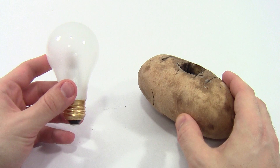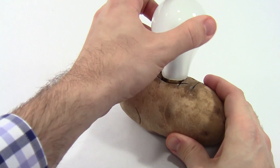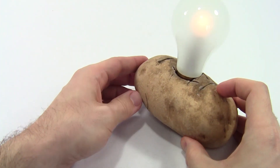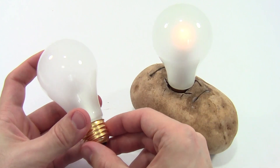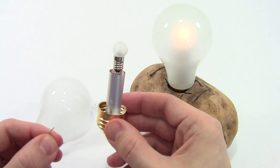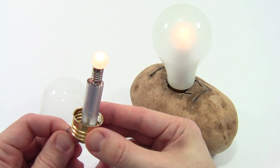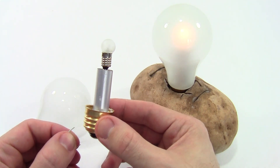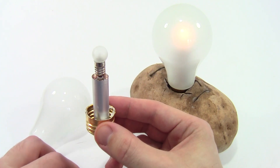What about the lightbulb? This one might seem a little more convincing at first. Here I have a potato with a hole cut in the top and what appears to be a regular lightbulb. When I insert the bulb into the potato and screw it in tight, it lights up. And this time, it looks like I don't have any hidden wires or cables. The secret here is that this is actually a prank lightbulb. I have a second one here that I've disassembled, and when I remove the base, you can see that it has a AA battery and a smaller lightbulb hidden inside. When something conductive, like a piece of metal or the electrolyte inside a potato, closes the circuit by touching the two contacts on the outside of the socket, it causes the bulb to light up, making it appear as if the bulb was operating with no true power source. You can just buy these online, or even build one yourself by carefully disassembling an old lightbulb. So this gives you something else to watch out for when you're seeing a video — there could be a hidden battery inside.